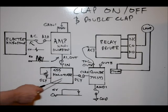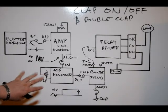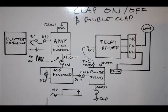The DLY potentiometer on the 555 timer lets us adjust our pulse width from very short to very long. We're going to connect the DLY output to an LED to see how long the delay is. We just want a delay of about 250 milliseconds, roughly one-quarter to one-half of a second. Once we have the single pulse, we've turned many pulses into one single pulse per clap, and we can use that to trigger our counter IC.